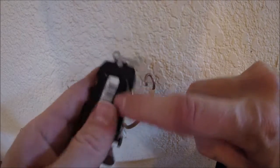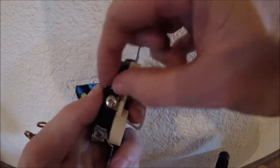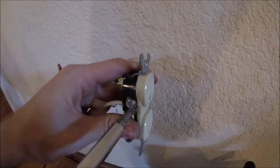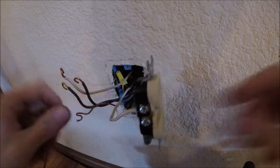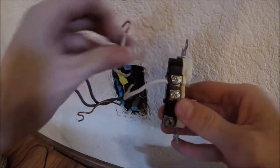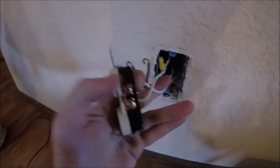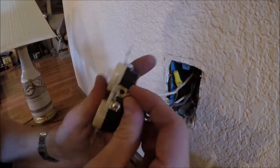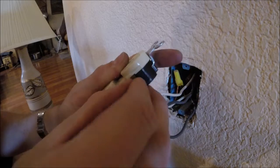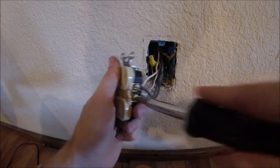You just want to put a little hoop in the wire like that. The white wire goes on the side with the silver screws — it also says 'white' on the back of the outlet. Loosen the screw, put the hoop around it, and tighten it down good and tight. Do the other white wire right below it. After the whites, switch over and do the black wires on the side with the gold screws. You can also remove the screw all the way, feed it through the loop, and screw it back in for a nice tight fit.